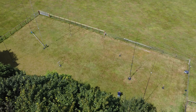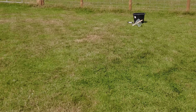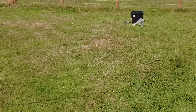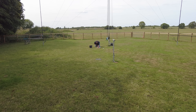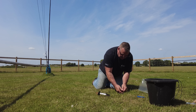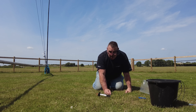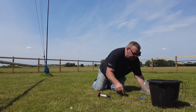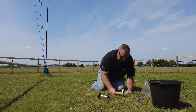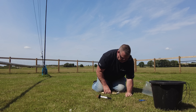That's why this massive four square here — that we're putting all these radials down for — is not going to work during the day, because it's a low-angle beast. During the day I want a nice simple dipole. Marcia said what we're building is effectively a spider's web, which is a good way of looking at it. I do remember a contest station — it might have been KC1XX or W3LPL — they wanted to improve their top band transmitter and put miles and miles of copper wire down, silver-soldered the lot together.